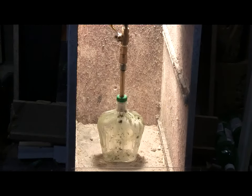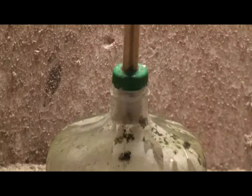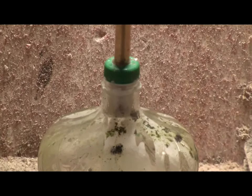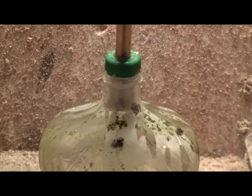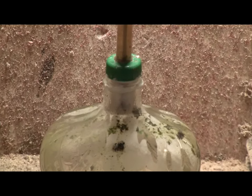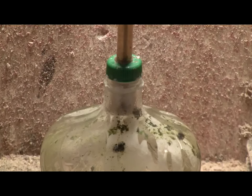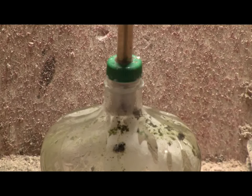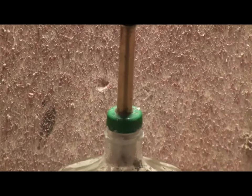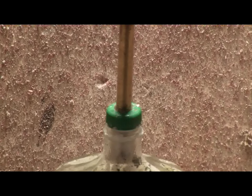What I did to prepare it was yesterday I filled the neck with epoxy after roughing up the inside of the bottle neck with a fine grit stone so the epoxy could stick better to the roughened glass. I let the epoxy harden and then drilled and tapped it for 1/8th NPT. I then covered the threads at the end of the brass piece with fresh epoxy and screwed it on.